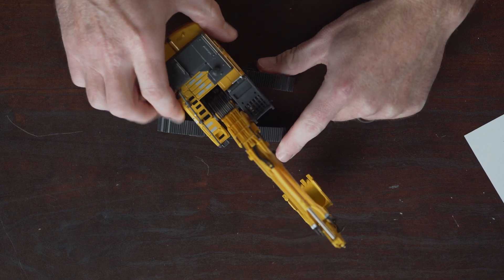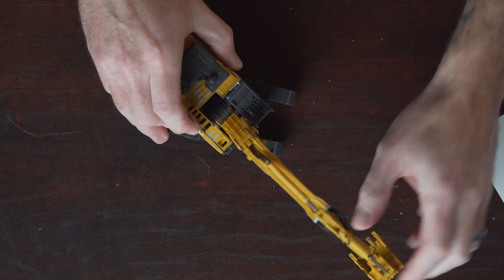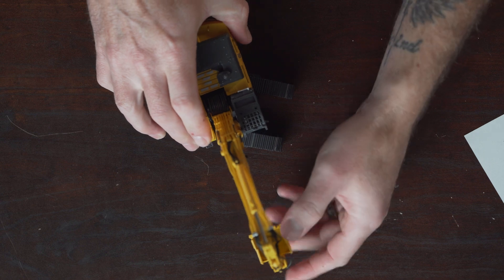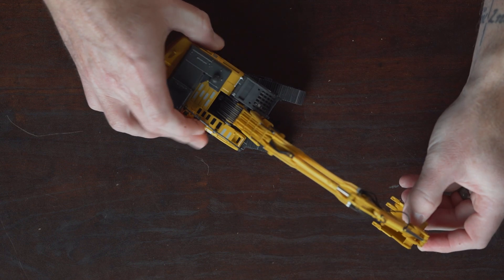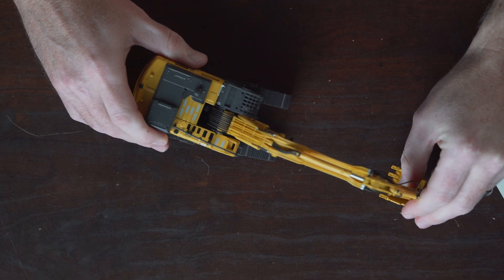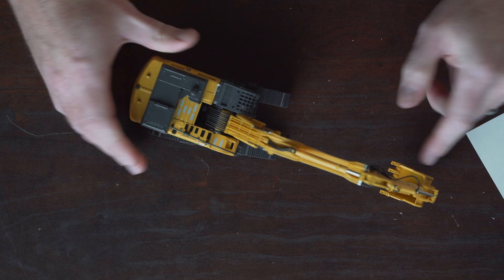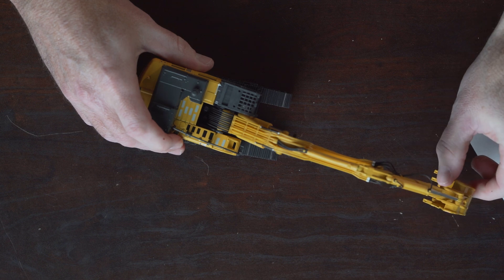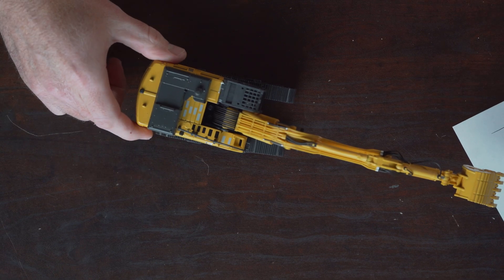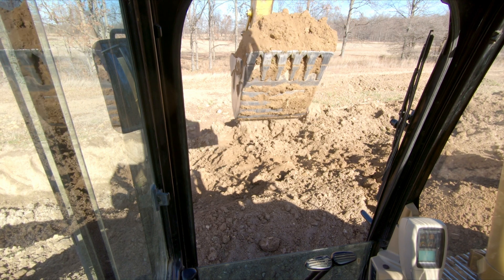We may start with our super-heaped, super-heavy bucket of material and as we spin we're going to stick out. But before we get to the point where we're fully extended, there's a key concept: we're going to boom up a little bit to give ourselves some room. Because when we go over our swing area and start to stick out, you're going to feel the back of your machine start to get light and lift up. If you start to boom down — don't drop it, but slowly controlled boom down — all of a sudden it isn't as heavy because we're letting gravity take some of that weight. Now I can reach out there at full length and just about the time I run out of boom I can dump that load and stay pretty stable.